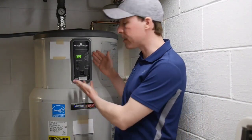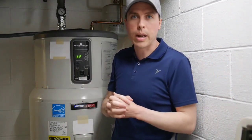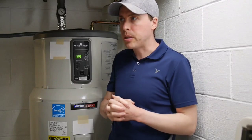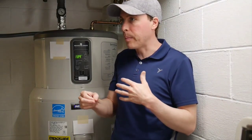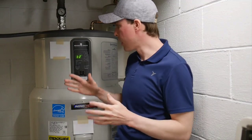Just to entertain that idea, I tested our mixing valve. I have a utility sink upstream of the mixing valve where I can get the really hot water and see what temperature it is, and then see downstream of the mixing valve — basically everywhere else in the house. The mixing valve is working fine; it's set at about 120 and I've seen it ranging from 120 to 122. They also said maybe the shower valve is bad, so I replaced the shower valve. Anytime the tank temperature number is high, we have hot water up there.